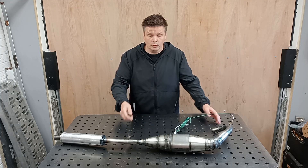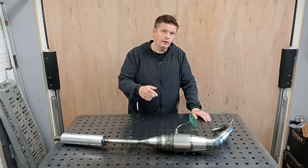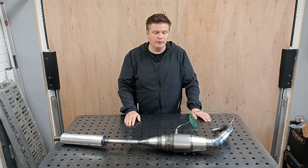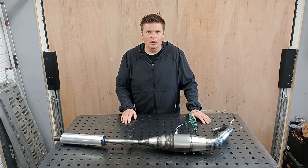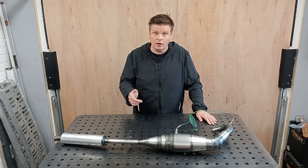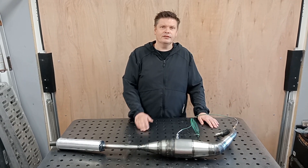Pipe done. I'm pretty pleased with that. Whether it works, I don't know — the dyno will tell us that, so that will be the next video. I'm not sure how well it's going to work. I think I've got ignition problems, so I need to run that on the dyno. It might be an ignition issue or it may be how this pipe works. I don't think there's enough blowdown time area with the current setup anyway — it's nowhere near Chris's. So potentially this pipe might rev but might not make the power because there's not enough blowdown time area. But we shall see. As always, thanks for watching — like, subscribe, all that good stuff. Hopefully I'll catch you reasonably shortly, a couple of weeks maybe.